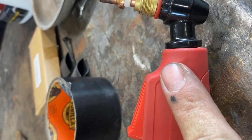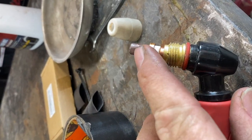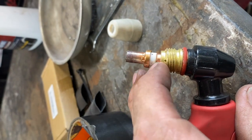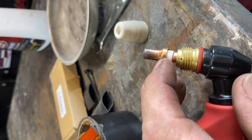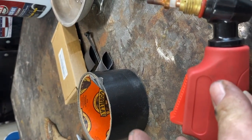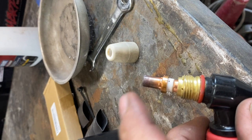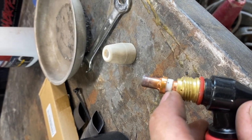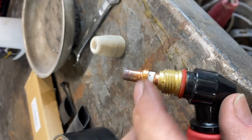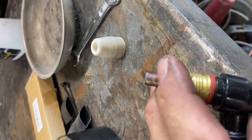The pilot arc does not work the way I ran it. When I went to turn it on, it wouldn't even strike an arc — not even for non-pilot arc. I figured out why: this ceramic piece is a standoff so the tip doesn't touch the pipe. The ground I ran to the machine off the pipe actually grounded out the torch, causing it not to work. Now I understand why that gentleman online ran a wire around the outside — that's what made it work.